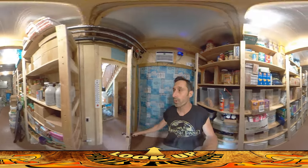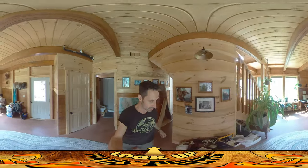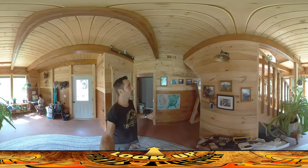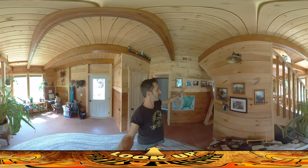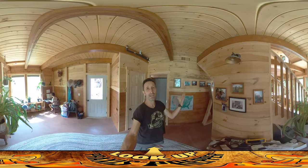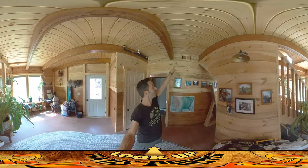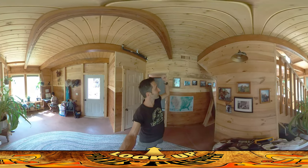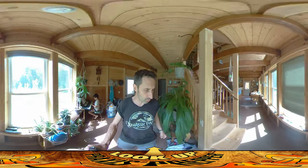The hot room is hot and I need to vent that heat outside during the summertime. I added an extra vent up here because there was so much suction in the hot room it was drawing a lot of hot humid air from the pantry area, which was making the pantry hot. So we added an extra vent up here to reduce the suction going into the pantry so it can draw more air from elsewhere. We always keep this one window open for now.